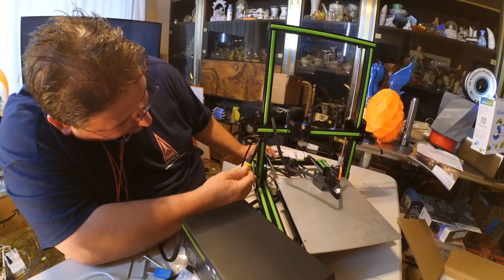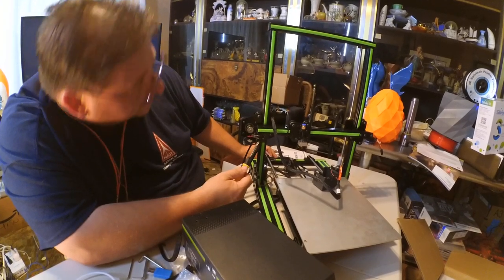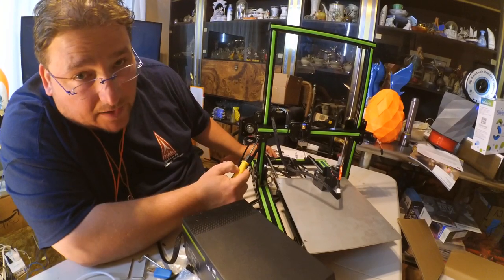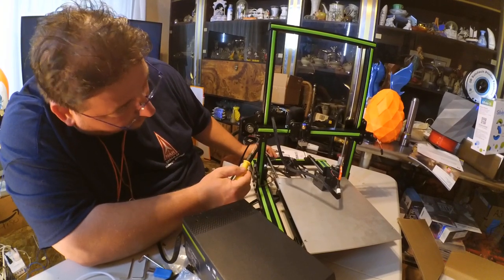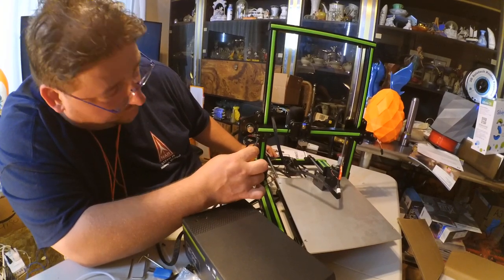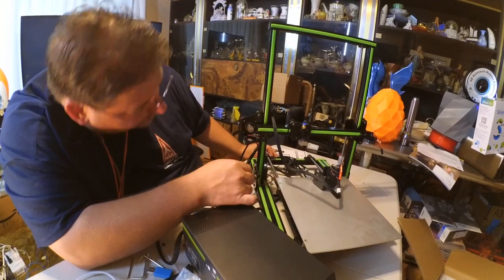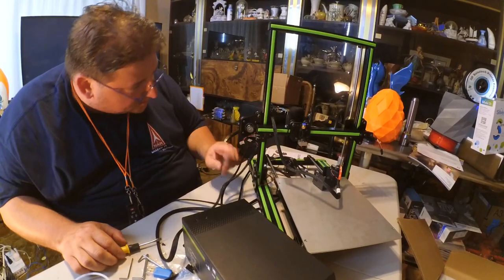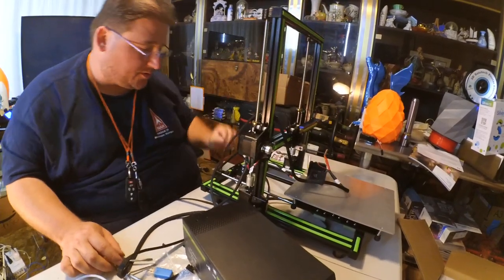This limit switch prong, electrical connection, was touching this bolt that holds one of the guide wheels onto the Z-axis riser, which is the X gantry, the X-axis. I could not slide it on, so I put the screwdriver in between the prong and the screw and bent it up a little bit, giving me clearance to add that. It won't hurt anything. That's something else they should fix. That's it. These are all clearly marked. X-axis limit switch, X-axis, extruder motor, all very clearly marked in English with the correct words.